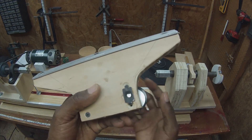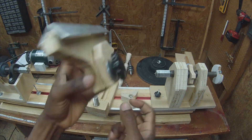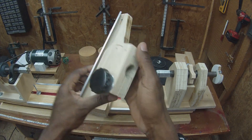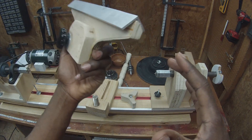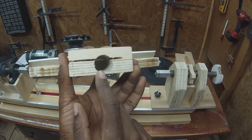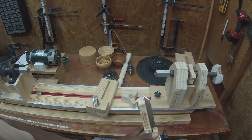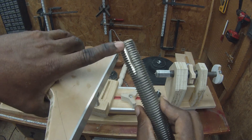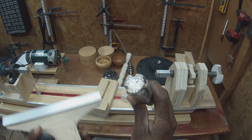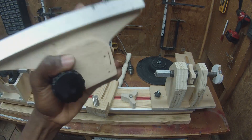This is basically a T-nut that I took out of a piece of salvaged furniture. This cut I made on the table saw — I ran it over the table saw to give me this slit, so there's just a tiny bit of slack there. That allows you to rotate it easily, and then you use this to clamp it down. One more thing: this hole is a little bit undersized. I basically took a piece of threaded rod — you can see it's got some slits in it, which makes it behave sort of like a tap. It's not nearly as good as a tap, but it did help to cut some threads and make the grip just a little bit better.